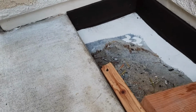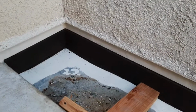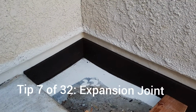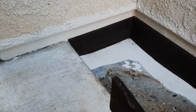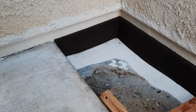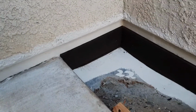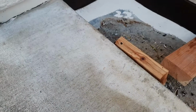And as you can see here, the material up against the concrete pad is this asphalt expansion joint, and that allows the slab to move and not butt up against or put stress on structures like my existing sidewalk here in the concrete slab.